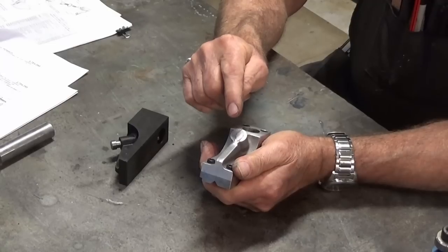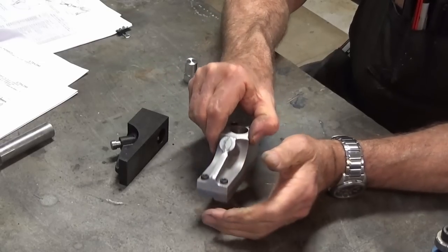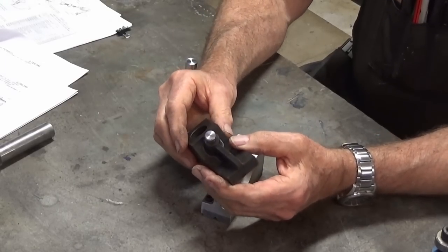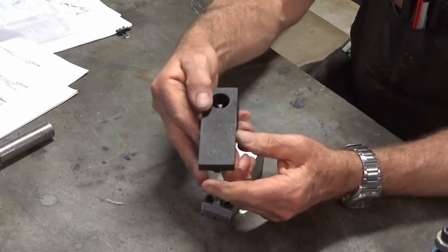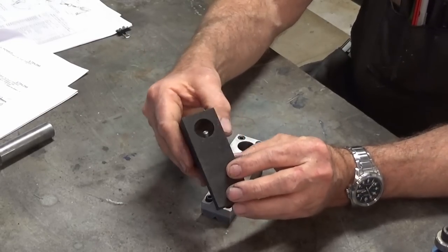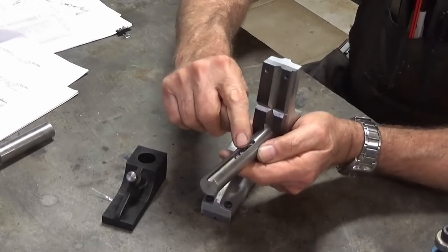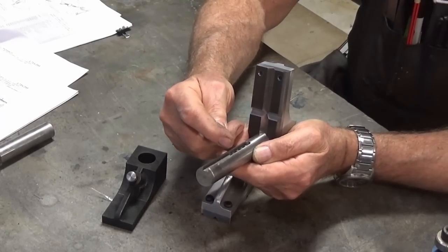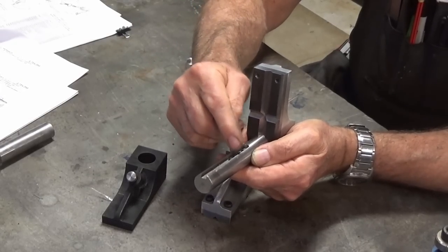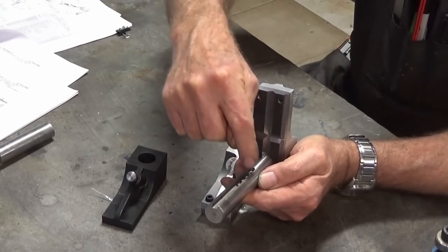And this is the part of the clamp that allows you to quickly reposition this particular jaw. So on the 3D printed mock-up here you can see that there's a pin in there and that pin projects through into the bore of the clamp body itself and that pin engages in this slot in this steel bar here and there will be a series of part drilled holes in the bottom of that slot there that allow that pin to actually grip into each of those positions.